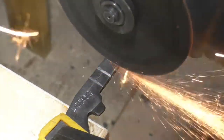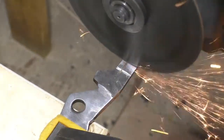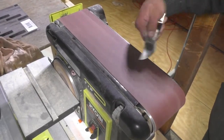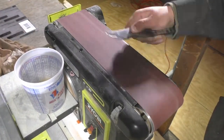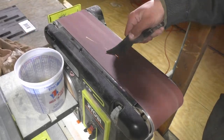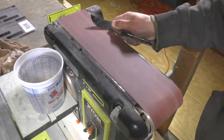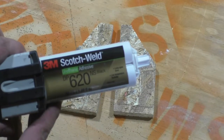I then clamped down the steel again and put some neat little tally marks in the tang. This will ensure that the epoxy has a good surface to hold onto, just like Jack and Rose from the Titanic movie. Before I attach the handle, I want to make sure that my initial bevels are established. So again I turn to my belt sander and grind away, making smooth level passes. Now that the bevels are as established as the patriarchy, I attach the handle and start the shaping process.